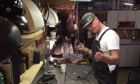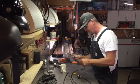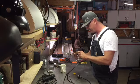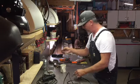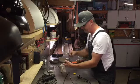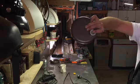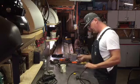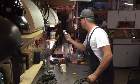I saved some stuff here. I looked for a gauge of wire thin enough to fit in this little cutaway for the wiring connection housing, which just sits here. I couldn't find one thin enough — as it is, I'm going to have to bend it just a little to make it fit. If I go with the gauge I want, probably 16, I could probably get away with 18 gauge because it's just a 40-watt bulb.